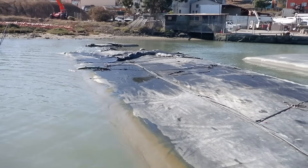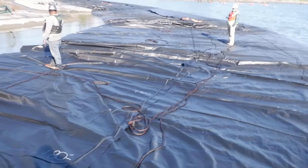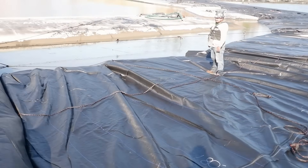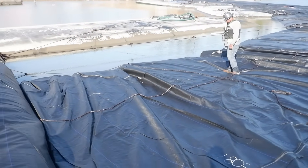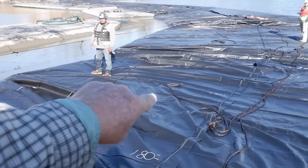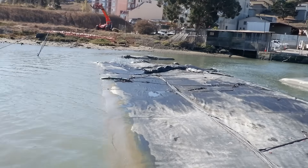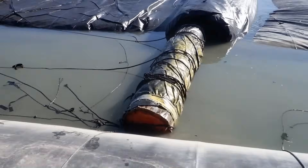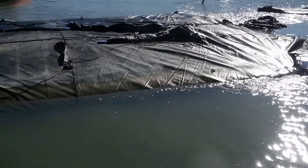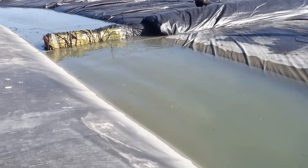We've got four six-inch pumps running now. Now that we've made our turn, we did have just two pumps running on one side and no pumps on the other side. Now that we've made the turn, we've turned the pumps back on so that each tube fills evenly. We'll have to make up for less water on one side after we get to the bank. Water is coming out, being displaced by this other dam going over the top of it — that's forcing the water out.